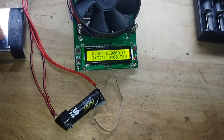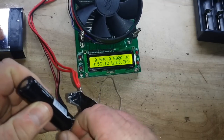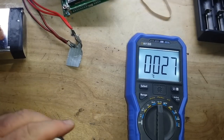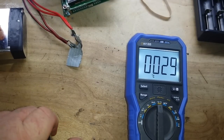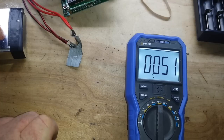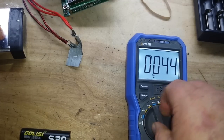Five minutes later and the cycle is complete. We'll disconnect the battery — it is quite warm. Let's put a thermocouple on it. We'll call it about 47 degrees C. At 35 minutes at four and a quarter amps, that's to be expected.